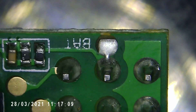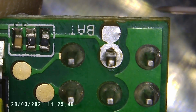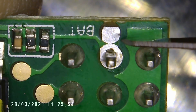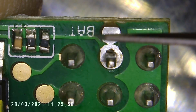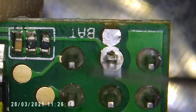In the first photograph we can see it in its original form. I've gone ahead and removed some of the solder. I'm not quite sure what that pad's purpose is, but what I'm going to do is cut through the traces here and then use that pad joined to the trace, as that will better support the wire that we need to add. Wish me luck, I'm going in.